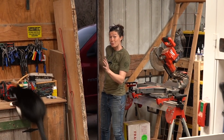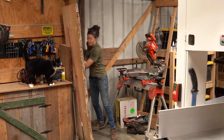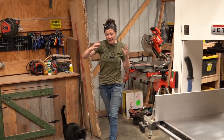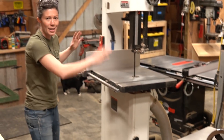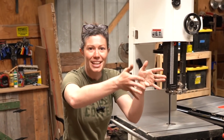From a workflow perspective, I need to bring wood in from the outside through this door here. I'll chop it down to whatever basic length I need, then carry it over and run it through the jointer and the planer that has the dust collector right there. This bandsaw moves around depending on what I need it for, but everything kind of has to be close enough to the plugs and the dust collector to make it work.